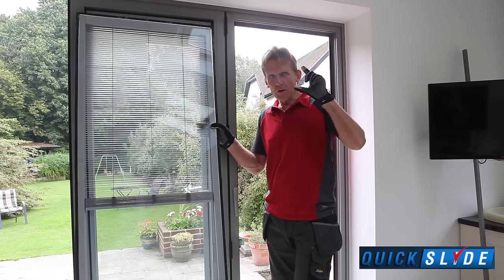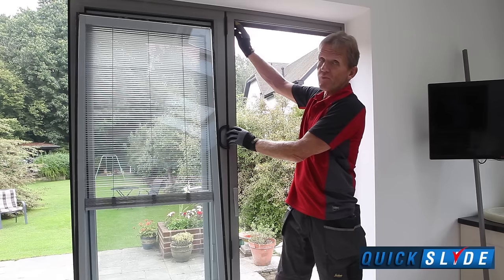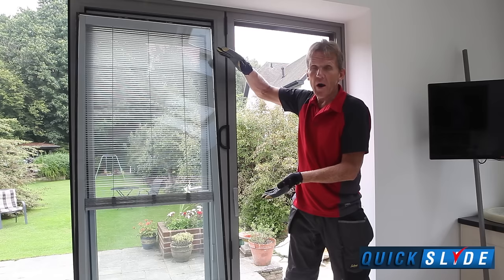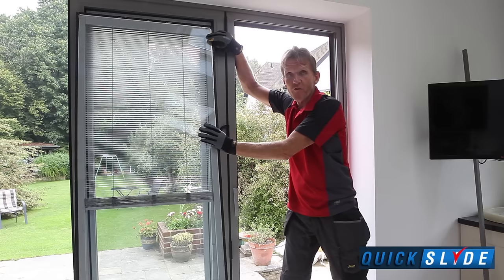When you receive your window, in the instructions will be a small leaflet which talks about toeing and heeling the glass. Now this is something that a lot of people get confused about. What the glass actually does is to brace the frame, rather like a ledged and braced door. Although this frame is nicely welded up and it's fairly rigid, what you find is that because of the weight, there is a tendency sometimes for it to just pull slightly down and go slightly out of square.